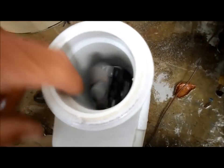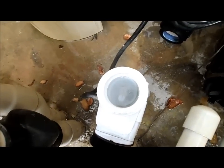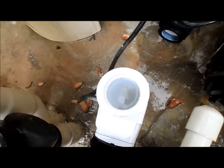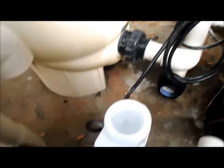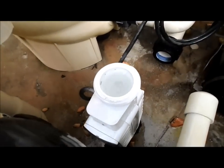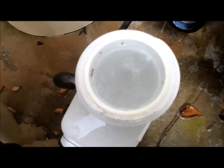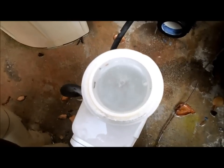I filled it up almost to the top with water, and I'm going to add some acid in there and see if it bubbles. It's bubbling — I'm going to dump a little bit out and add a little bit more acid to get it going a little more. The acid is very strong and I recommend getting this kind from my pool store versus the one at Home Depot, because that doesn't have as much power and it tends not to work as well. You can see it bubbling and that's what you want. You don't want too much acid in there because it will ruin the cell — you just want it to bubble gently like that. That will clean it in about 10 to 15 minutes, so we'll come back and see how it progresses.